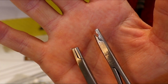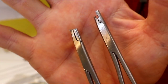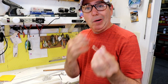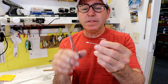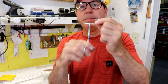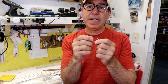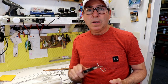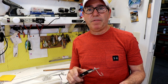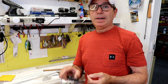The next step is to drill that little hole right there into the new end. There's nothing special about that hole in particular — it just needs to be big enough to go around the shank of the hook you're going to be using, but loose enough that it'll spin. The shank measures 1.9 millimeters or 0.0755 inches, so look for a 5/64 inch bit.